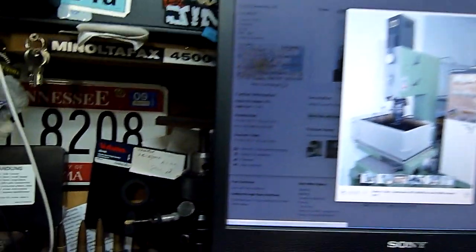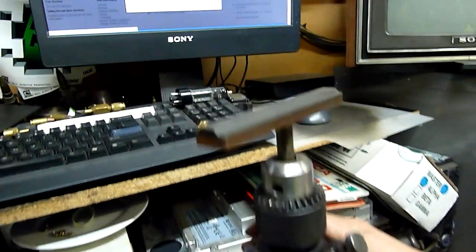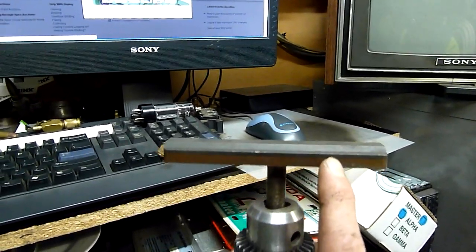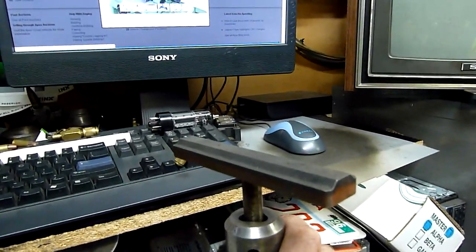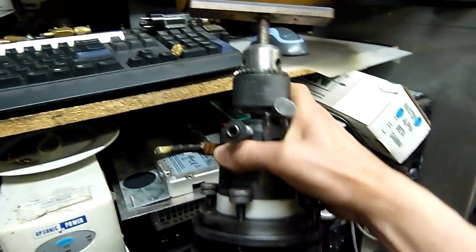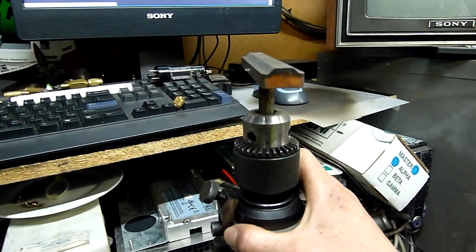It works by erosion through direct current. That's the head assembly from the old one - the old one was hydraulically driven, the new one's ball screw, thankfully, with a servo motor. Essentially all it does is pass direct current between the electrode and the workpiece. This one's got a profile on it that's a bit black from being burnt into material - it creates that negative profile in the workpiece like a die cavity. This one's mounted on a ball head so it's fully adjustable.